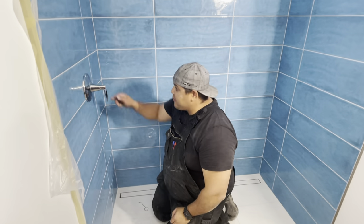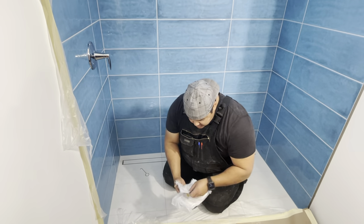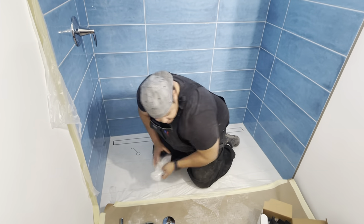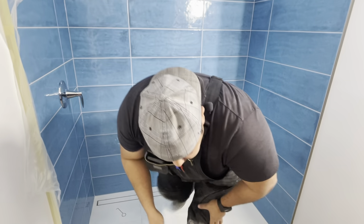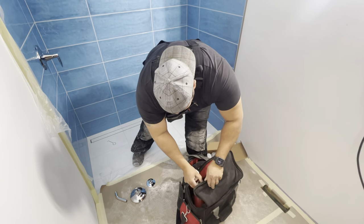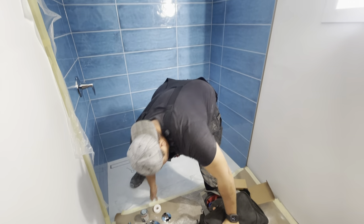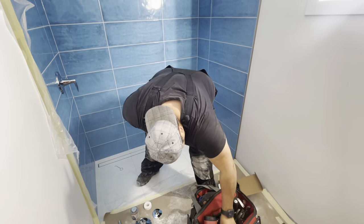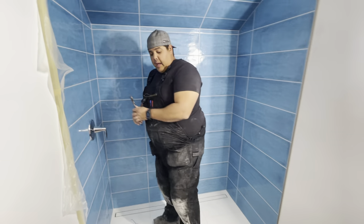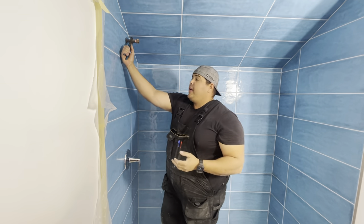I think that's more than the harder part of the valve. So we are just going to — if we do have extra parts, I just put them all in the bag, put them all inside there. And later if I find that I'm missing something, then I'm good to go. So now we are going to grab some Teflon tape, we're going to grab some dope, and we are going to grab a little pair of channel locks. So what I'll do here is we'll take the nipple off. In this case, the valve has been drained because we have the water shut off underneath.